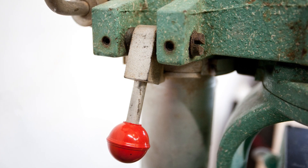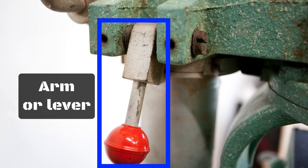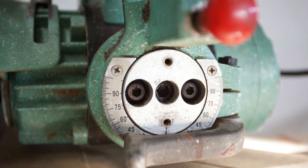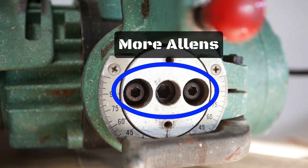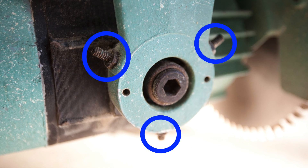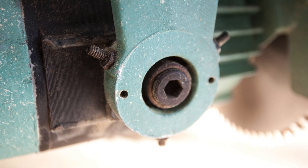One is for the arm on the back — there are a couple of little Allen screws that you can back out and then use a flathead screwdriver to move the position of the arm that goes down, so you can lock it into 90 degrees or 45 degrees and fine-tune it. That's the first step they talk about in the book. On the front of the saw, you can adjust your blade to the table to make it a perfect 90 degrees. And then there are further fine-tune adjustments on the back or side of the motor where you can adjust the toe and the heel of the blade. It's all explained in the book — get the book — and you will be very, very happy if you have one of these saws.